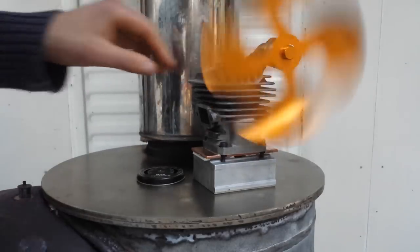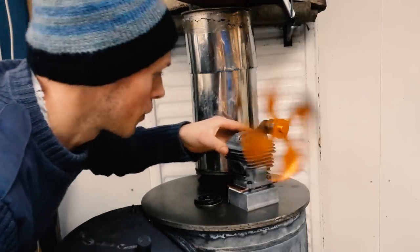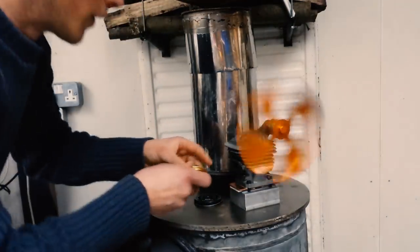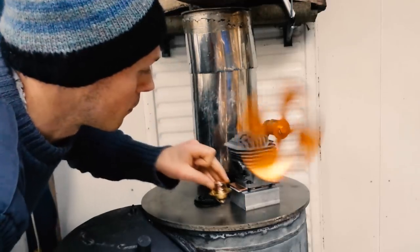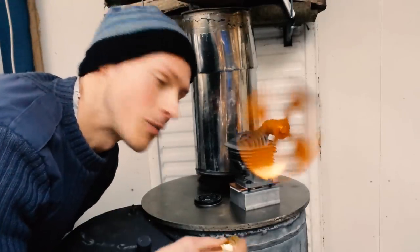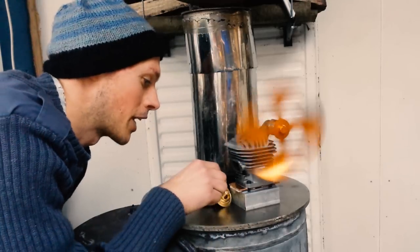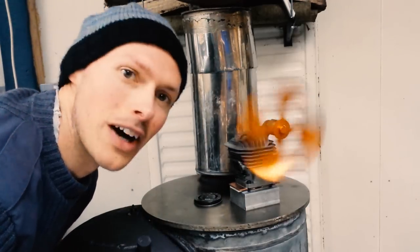So it's lowered enough to be near contact — it's not quite in contact, I can tell by rocking it. Another way of doing this, if I wasn't using a chainsaw cylinder as the cold side heat sink, would be to extend out here and just have a little thermostat mechanism to tilt everything up — to either side, something like that could work just fine. You could even add it on to existing stovetop fans, which would be quite a big improvement, especially if you've already replaced the Peltier TEG elements once or twice. I definitely recommend creating some kind of safety system like this that prevents overheating.